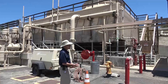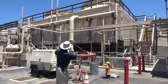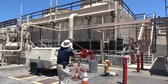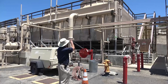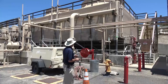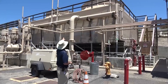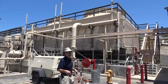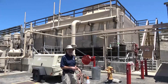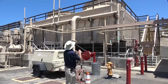It's counter-flow because the air direction and water direction are counter to each other. In this particular device, air is drawn in through the open sides, then moves upwards and passes through what we call packing, which can also be called fill. This is all done under the influence of the fans — there are two large fan housings up top, each with about 14-foot diameter blades.